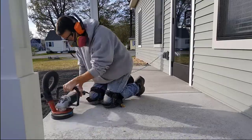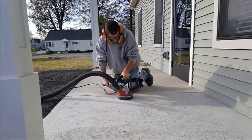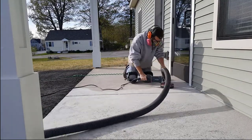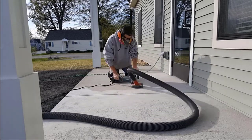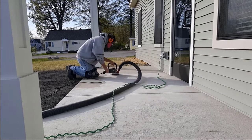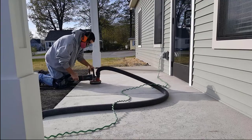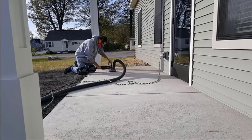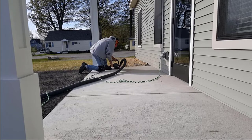As you can see, I'm grinding that concrete. I've got a 7-inch grinder there with a diamond cup wheel on it, hooked up to my vacuum so it doesn't make too much of a mess. Got my knee pads on, my mask on, my hearing protection on, and my glasses on — you're going to want all that stuff if you use a hand grinder. It doesn't take very long; this probably took me a total of 15 or 20 minutes to grind. You just slowly go back and forth, nice and easy — you don't want to go too fast or dig in. I've got the video sped up here so you don't have to watch me for the whole 20 minutes. The key is to get this ground and clean before you start your repair.